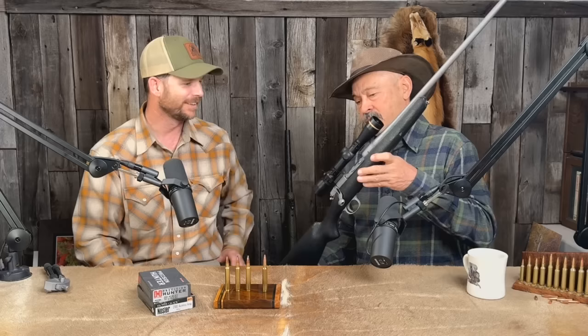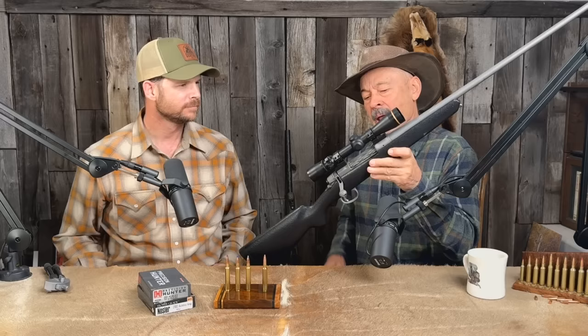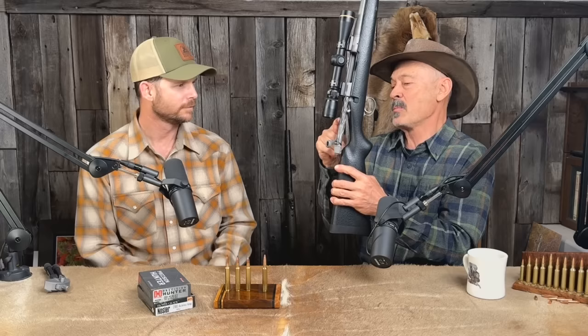What Lex does is he starts with a Model 700 action — so many custom builders did back in those days, and they still do. He shaved a little bit off of it — carved some dimension off the front receiver ring at the back where you no longer need that mass, since the locking lugs on your bolt face are locking into the depths of the receiver. He's trimmed that down and carries that through the action on both sides. On the shroud at the back of the bolt, he's shaved it into several flats with a diamond pattern. Deep fluting on the bolt, skeletonized the bolt handle. And as you can see, he's got a pencil-thin barrel — like a spaghetti noodle — but it still shoots half MOA or better.